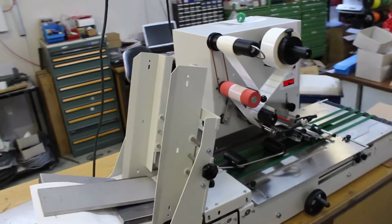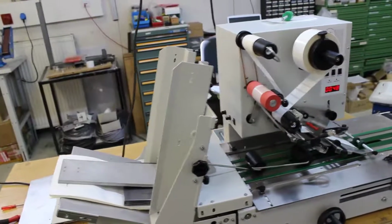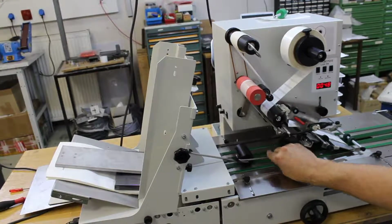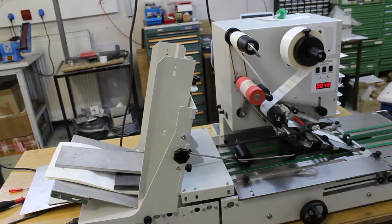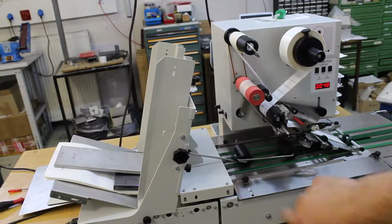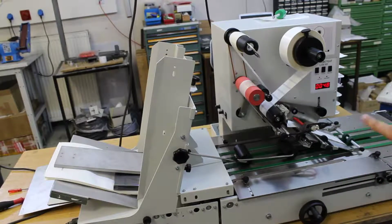Then you have to make sure, you can see that here, that you attach this part here. These are just two plastic reels which apply extra pressure on the product itself to make sure that there's enough traction to move the product over the conveyor belt here, right? Then once you install the labels, now I just produced some random labels, you can start the labeling part, you can start the main conveyor belt, and then you have a separate button. You also have a separate power supply.